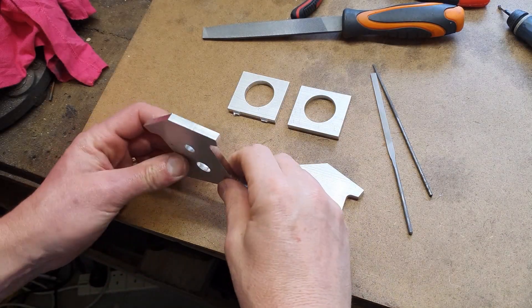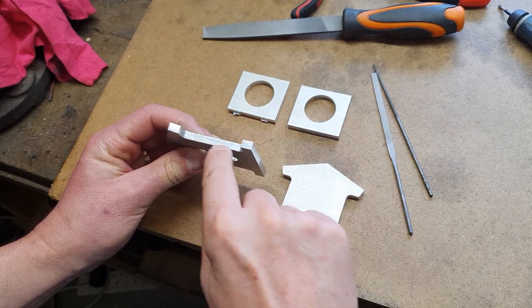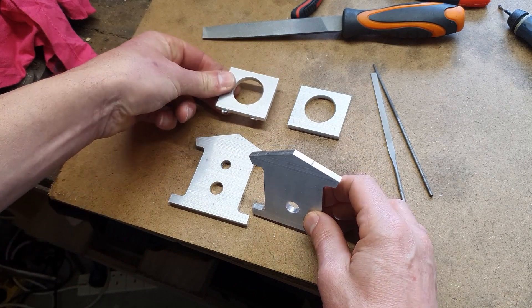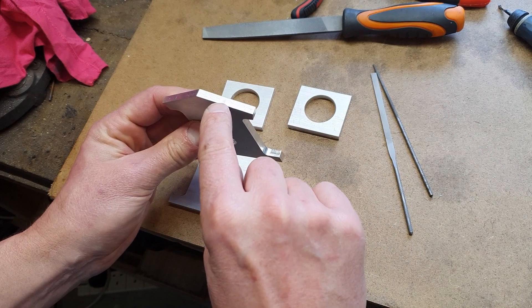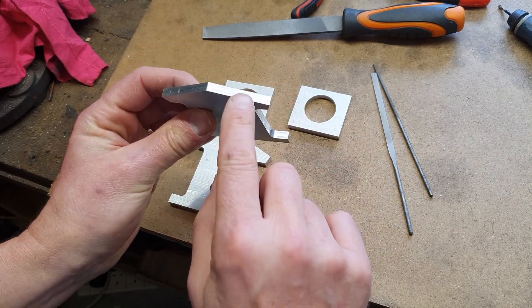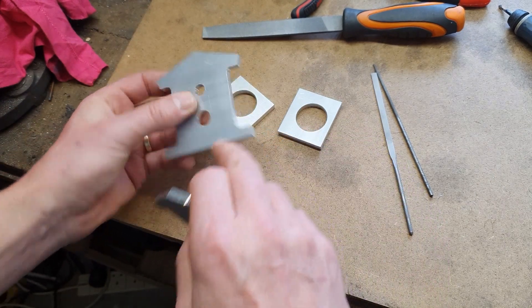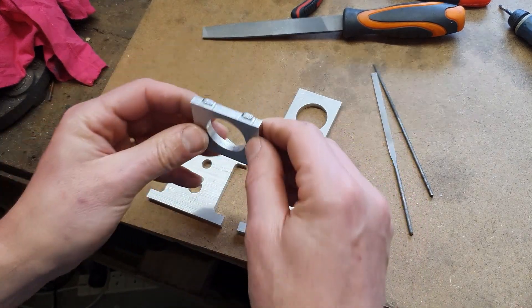All those parts came out pretty well and we've got a few tool marks where obviously my CNC router isn't really rigid. We're still going to get a few tool marks around there but we can obviously file those off at a later date. We have to use tabs to keep the aluminium in while we're cutting it, so where it comes across those tabs when cutting we get a bit of tool deflection. On these pieces it didn't really matter so much because I had two on the bottom and then one on each of the tops. Eventually that's going to be covered up by the crankcase tops, so that's no problem. There's also a little bit of tool mark here, and the bottom one is more or less filed off on the bottoms.